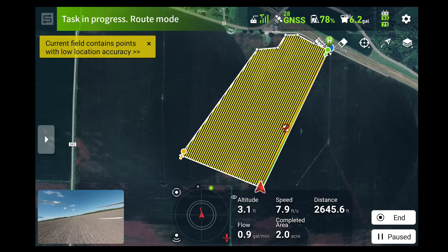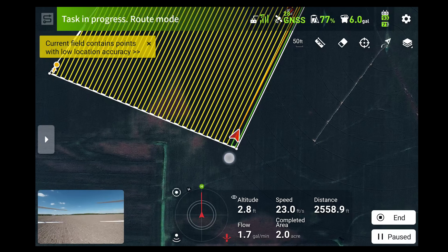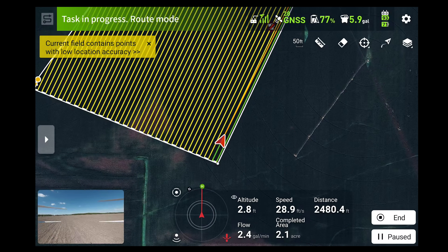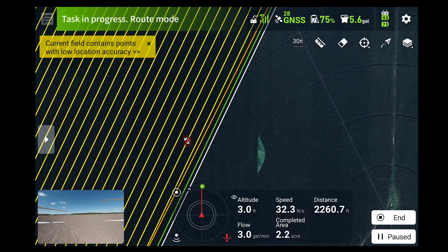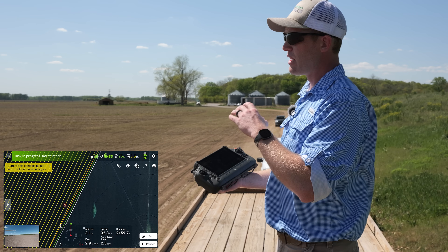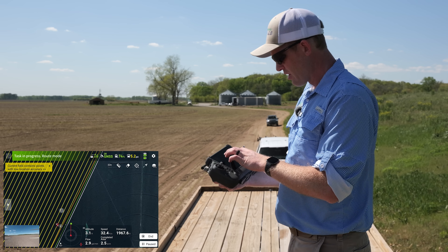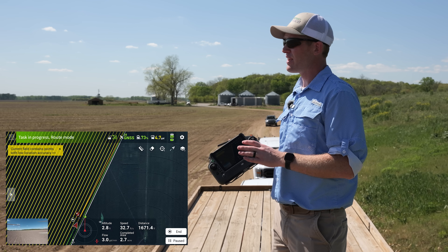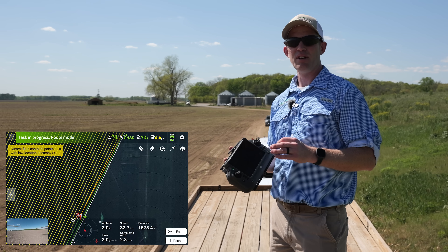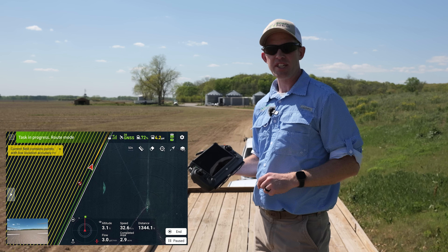As you can see on the screen, we can monitor the progress of the drone. The drone's location is shown in red as a triangle. This is a half-mile long field, so I've made it down 2,600 feet, turned around, and I'm spraying back. Up here at the top, we can view our live volume — about 4.9 gallons left. That's volume by weight. The T-50 has scales on the tank that measure the weight, convert it into volume, and give us a live readout.